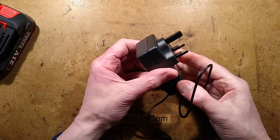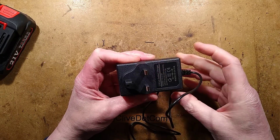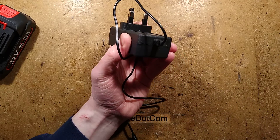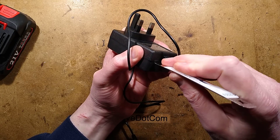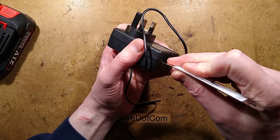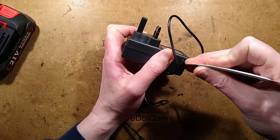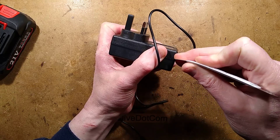Let's see if we can open it. There are no obvious signs of screws. That's a laser-etched label by the look of it — it's got that slight abrasive feel, or just moulded. I've got the spudger here. Is it going to be ultrasonically welded? It does look as though it may open. Which way does the spudger slip in? This may take a while, and it may be a one-way destructive trip.